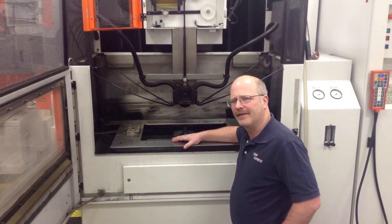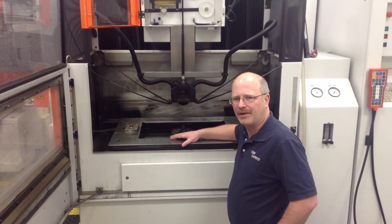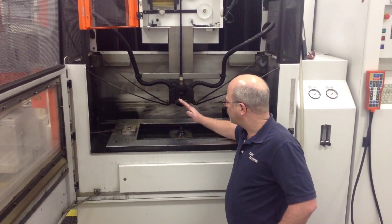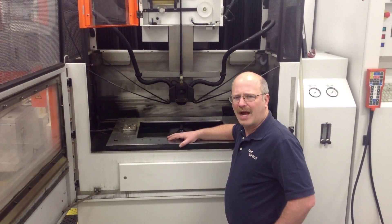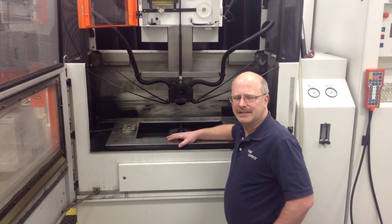I like to think of an EDM machine as nothing more than a high-tech band saw. We can program any profiles you want on our CAM system. We can also program tapers, which is important for machining tapered bores, putting draft relief on plastic ejection pins, and putting relief on stamping dies.